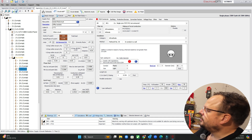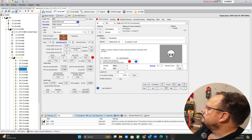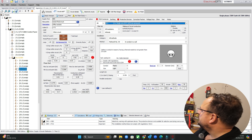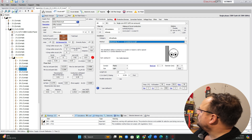We can say how many watts per point we want on there, so we'll make an assumption that it's only really going to pull a maximum of 300W, and we've got one, two, three, four — we'll say six sockets on there. With this one it is a single-core cable so we need to find that — it's XLPE non-armoured — so make sure we choose that. We'll run it to 70 degrees and it is going to be in conduit on a wall, so we'll change that option to 'in conduit on a wall'.